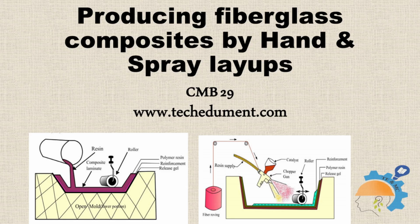Layup process is a molding process for composite materials, in which the final product is obtained by overlapping a specific number of different layers, usually made of continuous polymeric or ceramic fibers, and a thermoset polymeric liquid matrix. The present lecture introduces open mold hand layup and spray-up techniques.